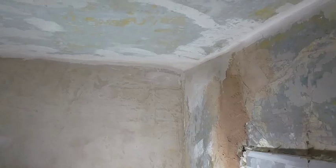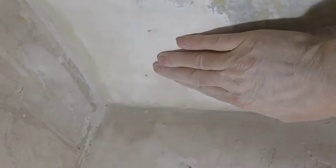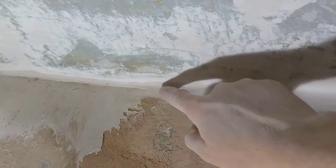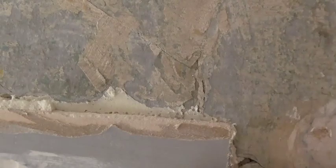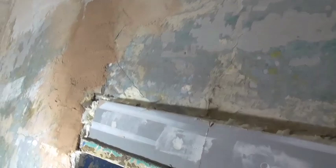I'm in the process of sanding the ceiling. Let me just show you this corner again — all the process it's gone through: the foam, PVA, and then the filling. Nice and solid. So ready for another coat of PVA and then ready for the lining paper. I'm still finishing off the walls with the filling — I've done all the ceiling so I can get it papered and then do all the rest of the filling for the afternoon so it's dry for the next day. That's a bit of undercoat plaster there and I'm going to bring some across here to even it all out, because it's nice and flush there but then it steps out — there was a big dip — so build it all out and it'll be sorted once finished.